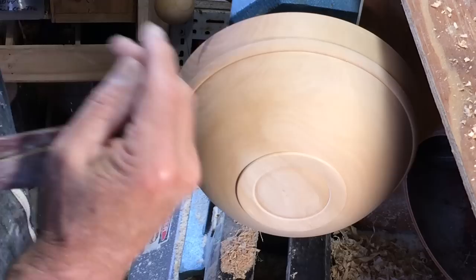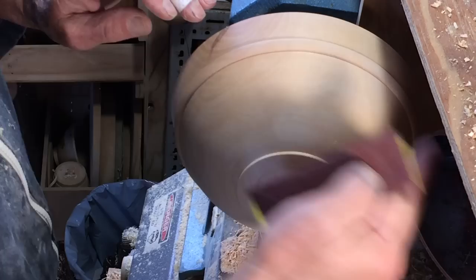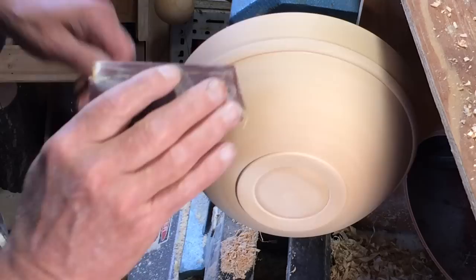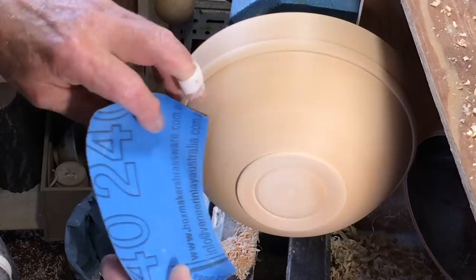This grain is picked up very slightly there. When you're hand sanding with the lathe in reverse, the little fibers which have been brushed this way get brushed the other way and they come out pretty quickly. Then 240 grit, and I'll use a rotary sander for 400 grit.